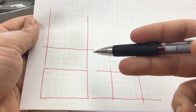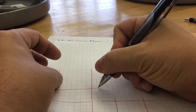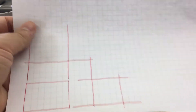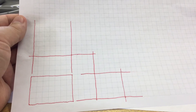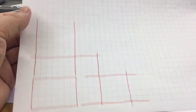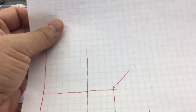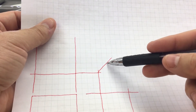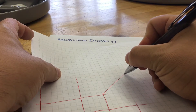If you bring this line across and this line up, where those two meet are projection lines. This one comes in this direction, this one comes in this direction. Right where those two cross is where we're going to get our orthographic projection line. Our orthographic projection line is a light line drawn at 45 degrees, and it goes through each individual block. So from here I'm going to go corner to corner, continuing to split these blocks in half through the middle of each block.